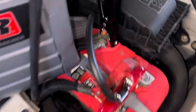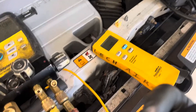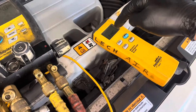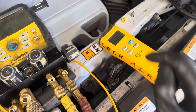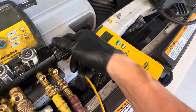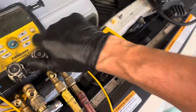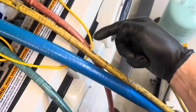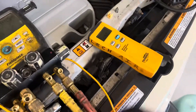Did I just go over? I was looking at the screen and there's a lag time between the screen and what you see with your eyes, and I missed it by a few grams. I'll go get my recovery unit — I just made a mistake. But first I'll start it up anyway. Actually, there's about 40 grams stuck inside this hose, and another 30 to 40 grams inside the other hose. So in total, I have 60 to 80 grams within these two hoses depending on the pressure.